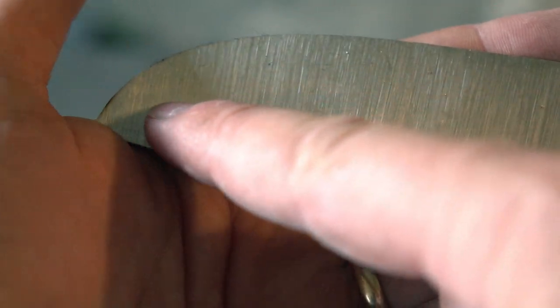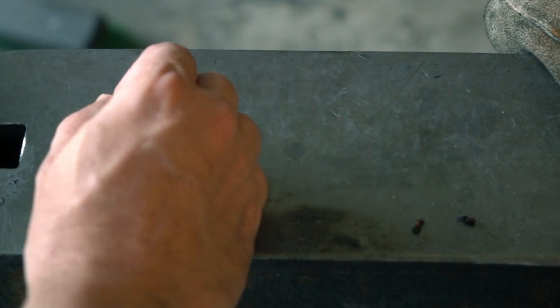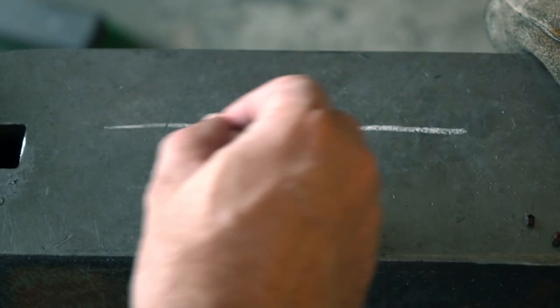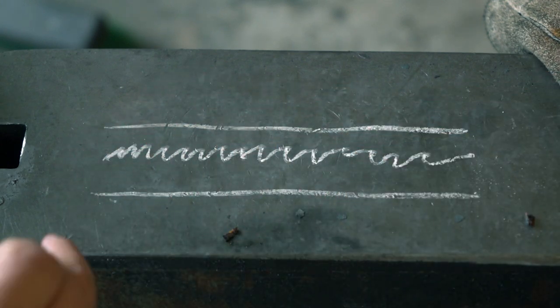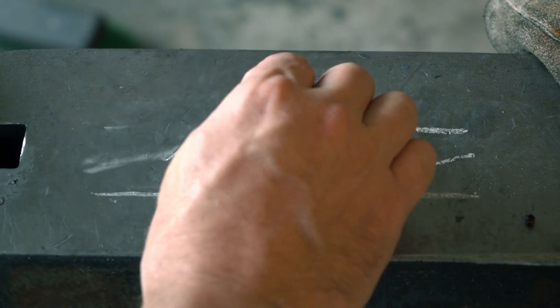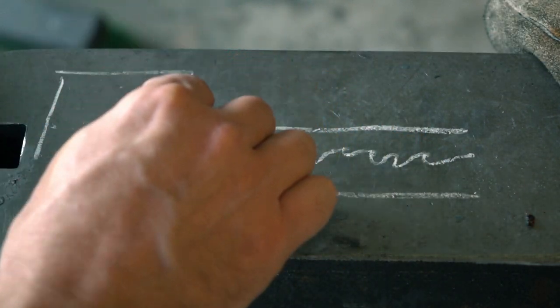This is a knife I made out of the collar, just between what's now the cleaver and that kiridashi, that area of steel. And it's the same thing, lines and voids. I'm again halfway through the steel. And I don't know if they were there before heat treat. I heat treated, then I ground the blades, both of those. But I suspect there's an area of bad steel in cross-section there, the squiggly line.